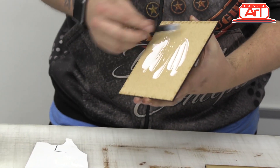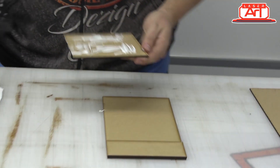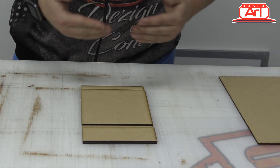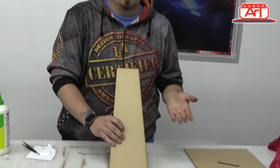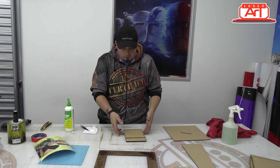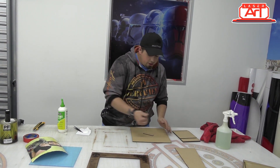Make sure we apply a generous amount of glue. You can use a lot less — it's up to your discretion. Now, depending on the size of your frame, you need to decide how far back you want this groove to be, because it's going to slot in to prevent the frame from falling backwards or forwards. I'm going to do it right at the end as shown. You do have room to move it either way. Now we'll set this off to the side to dry and move on with the back of the frame.